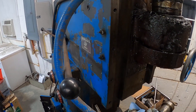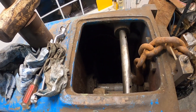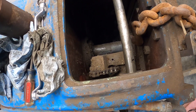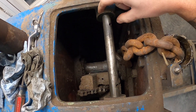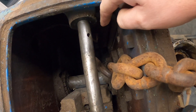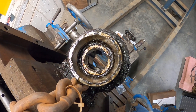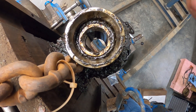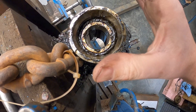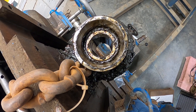The way this thing works: we've got some counterweights — see if I can get on this thing without falling. There are two counterweights inside of here, looking down inside the head. Two counterweights on a chain, and there are normally two big sprockets — I'll show those in a minute — that carry the counterweights over and help lift the head on the outside. Looking down through the spindle drive here, down inside there's a gear that is driven — a pinion or crown gear — kind of like a ring and pinion essentially, like in an axle.